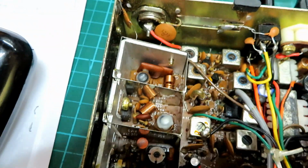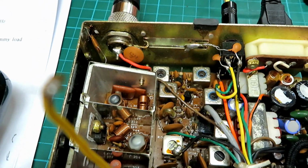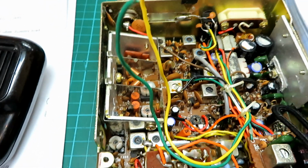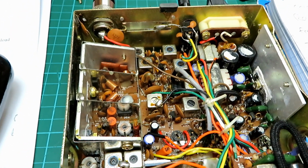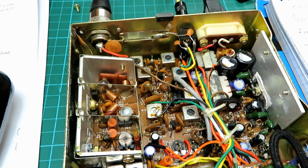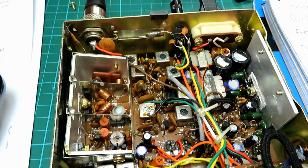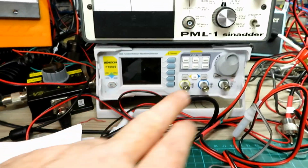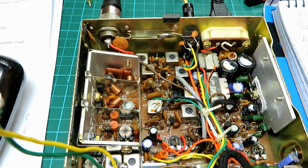It's the same procedure, I think, as on the other Commtron, where you wind this counterclockwise from peak, and that seemed to drop the harmonic down a little bit as well. So I'm happy that's okay on transmit on FM, and we'll do some tests on AM a little bit later on, because I've got to pop this signal generator in place there, but we can certainly test transmit on that.